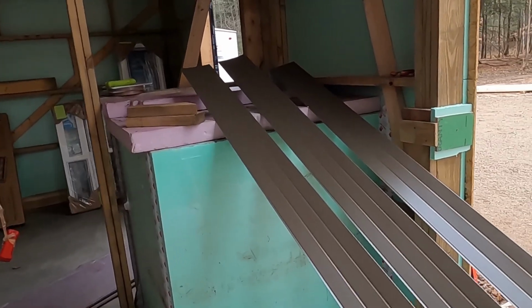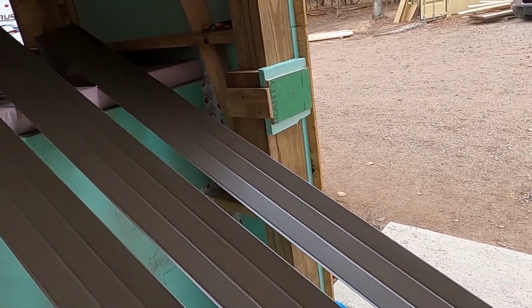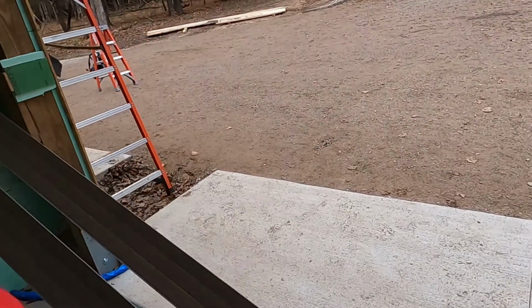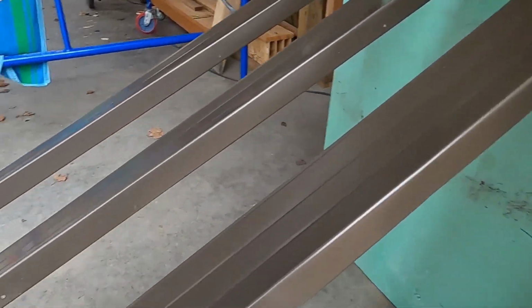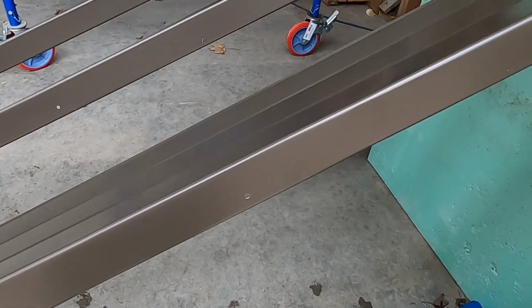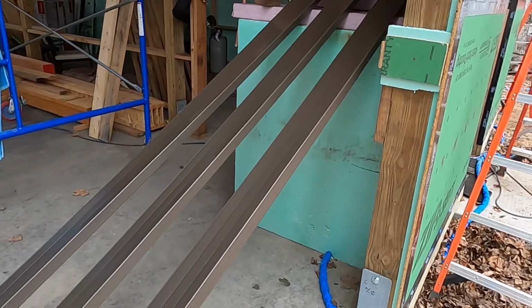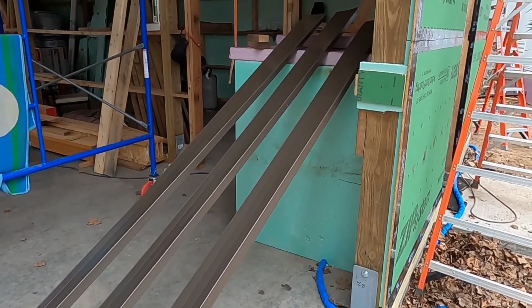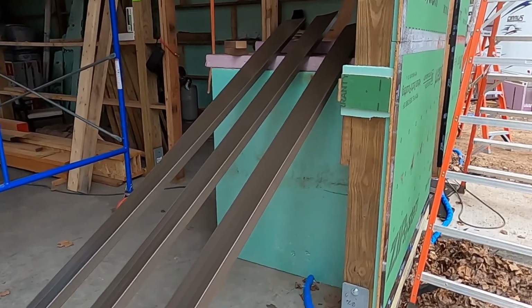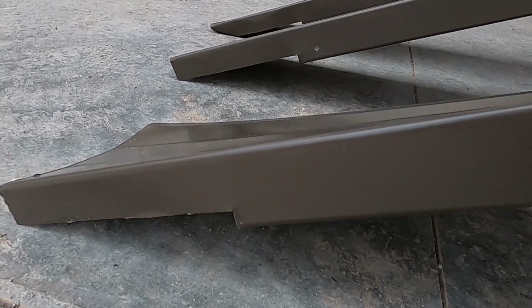Speaking of fascia trim, I've got most of it cut, and I think I have an order of events for installing it. We'll install the trim on the eaves first. I have 36 feet of it or so pre-cut and pre-drilled. So I drilled it 24 inches basically. And we'll use probably a 2-inch washer screw on that just in case you get any water that pulls over it. So I think that's reasonable. I did a little trim on the edges here so that they'll set 6 inches overlap, and we can caulk the heck out of that overlap.